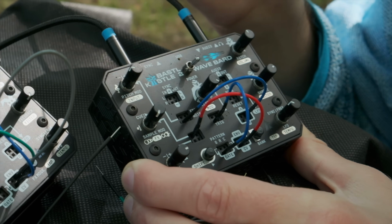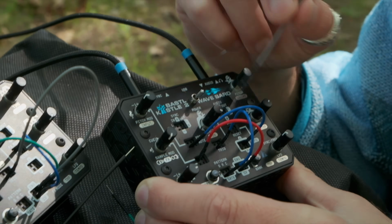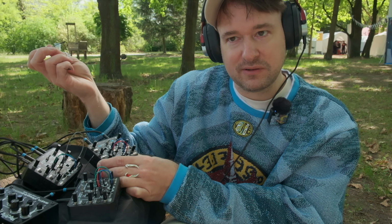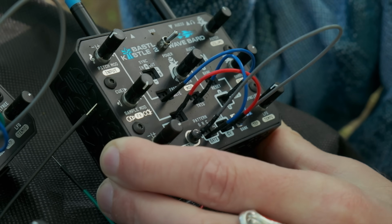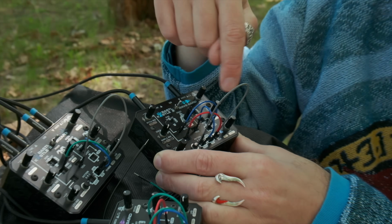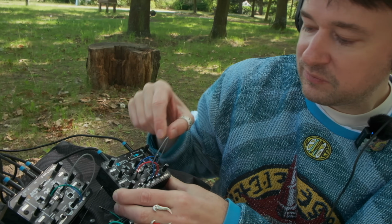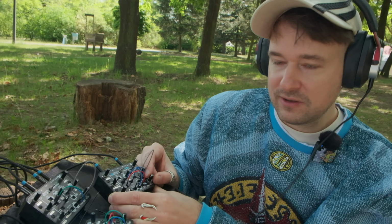The pattern side there is actually for selecting, so these are inputs for the pattern generator. This is a way how you can, with patching, have the patterns evolve over time. Right now it's a static pattern. If I wanted to alternate the gate signal, the rhythm, I can connect the G input on the pattern section and feed CV into it. Now it would be semi-randomly alternating the pattern. G is gate and R is reset for both gate and CV. So you can use the LFO to reset both. That's also fun, especially with the synced LFO. So you can shorten the pattern like this, to one step.